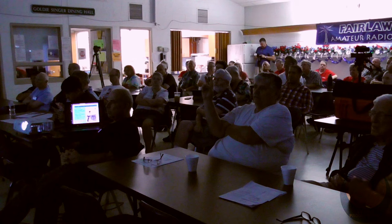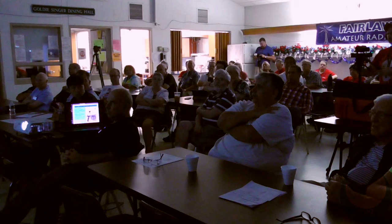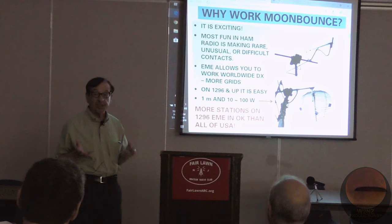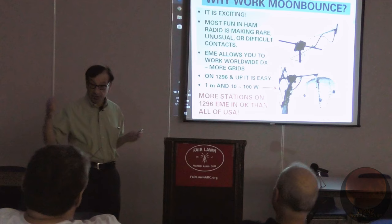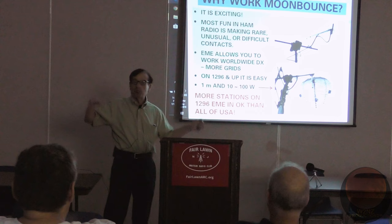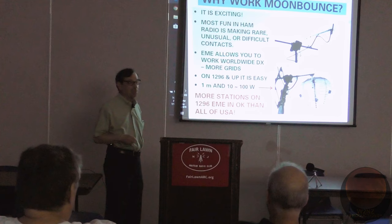How much energy do you lose between transmit and receive? Between transmit and receive, I think I have that information here later on. But it roughly is, and it depends on the frequency and what you're using, but the loss is around 200 and let's say 260 dB, because it does vary with how far you are from the moon. It's really a weak signal. I've heard analogies where someone says it's equivalent to a fly flapping its wings at so far, but that doesn't have any meaning. I have no idea how much energy a fly makes flapping its wings.